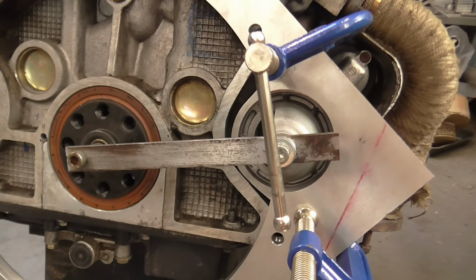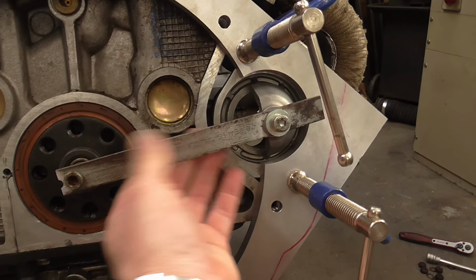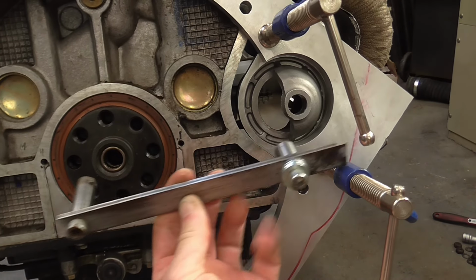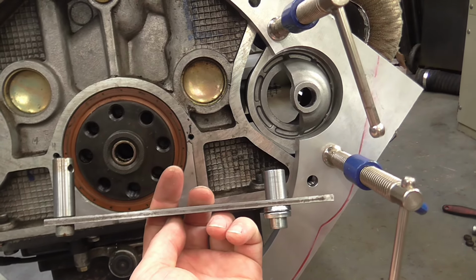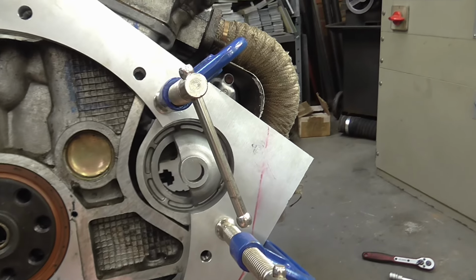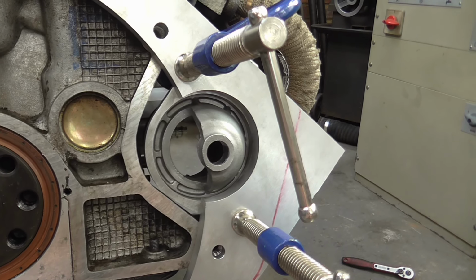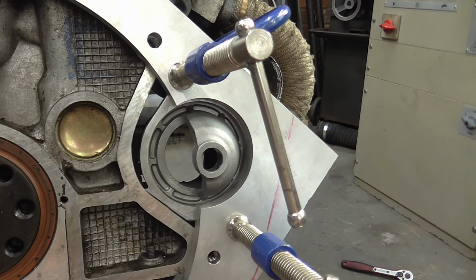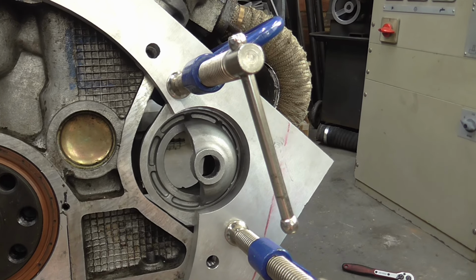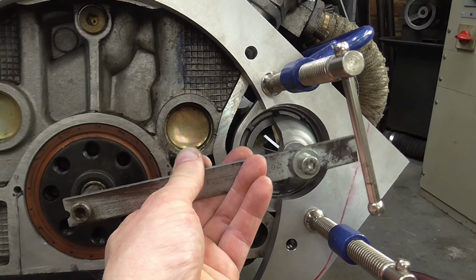And I have my alignment bar in place to get the center distance set. So it is a little tight in the flywheel spigot, but that just has the 2 posts with the correct distance set between them, and the starter motor casing currently has the sintered bearing to support the output shaft not in place because that was worn out and is being replaced, but that made using the alignment bar quite easy.